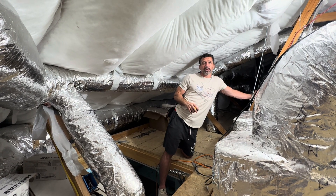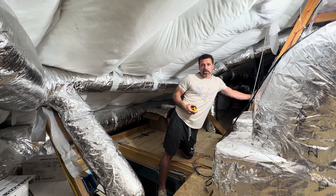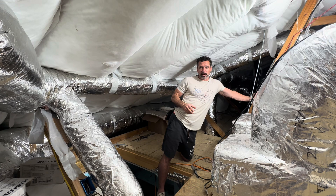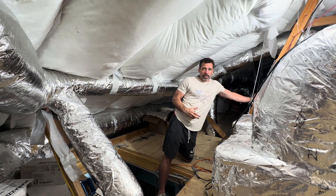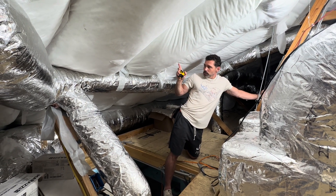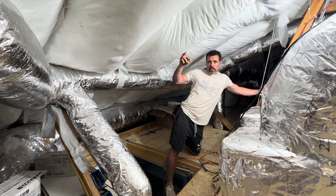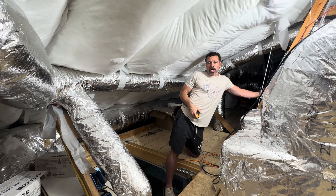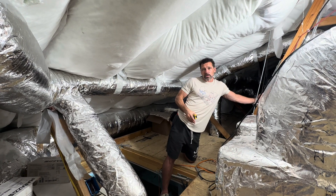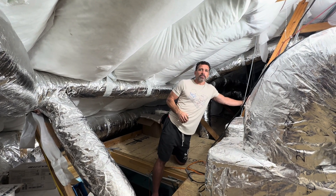I really like this approach because I'm not smelling anything toxic in here — it has no added formaldehyde. I have roughly double the insulation of spray foam's R21, and the cost is approximately half of what I was paying for spray foam, so this is a huge victory. We handle the walls pretty much the exact same way, except walls are two-by-four or two-by-six so you won't get this thickness, but it suffices in all code situations, especially when you add exterior insulation — though exterior insulation is not required on walls. Hope that helps, adios amigos.